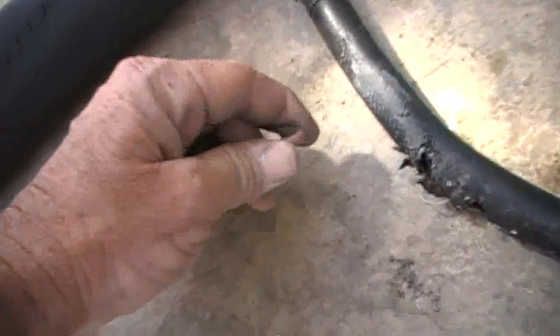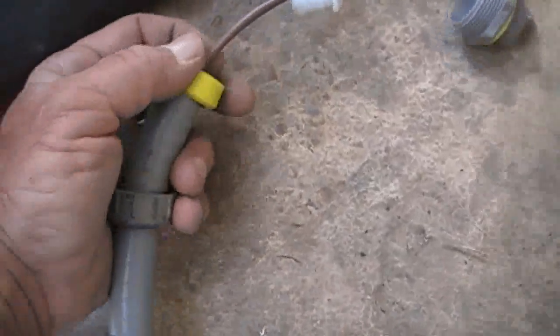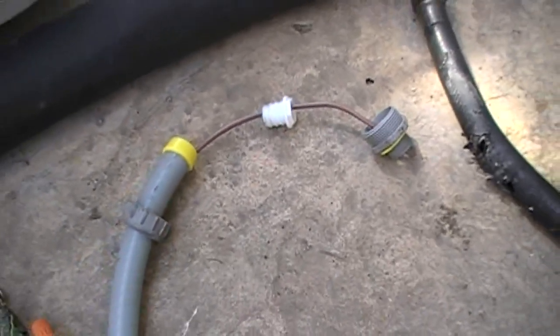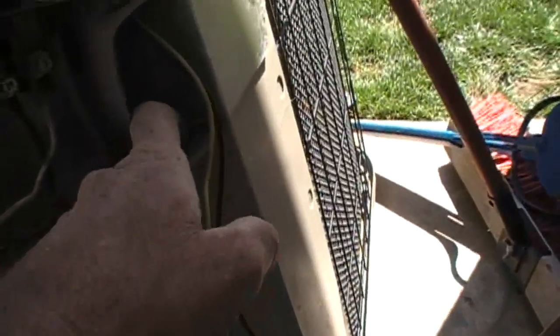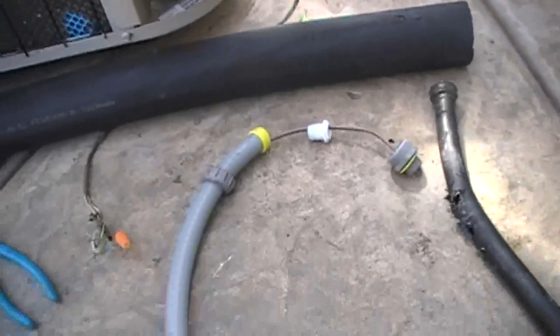Just sleeve your thermostat wires: bend it over, feed it in through the conduit, put your fitting over it, expand the fitting, then slide it down and assemble it much more easily. Get the wire through it first — that way you don't have to worry about losing pieces or, if you're new at it, knowing which pieces go in which order. Fit it all in, put your lock ring right inside that electrical connection area. Don't lose any fittings.